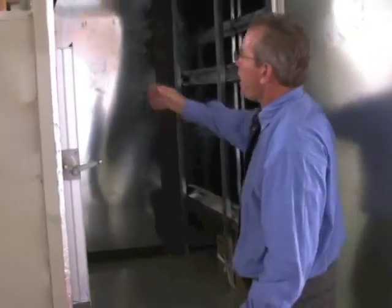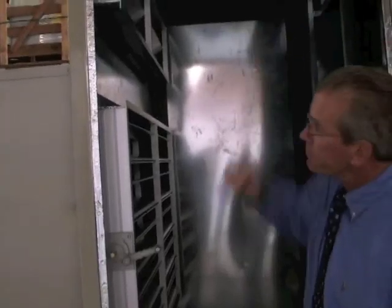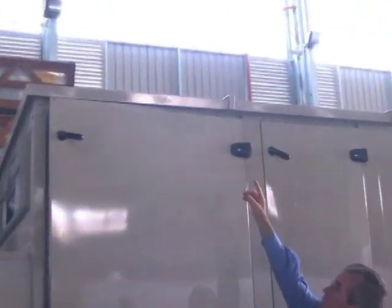You can see that the cabinetry is all double wall. It's actually double-wall galvanized on the inside, and on the outside of the cabinetry is galvanized, then powder coated, then top coated with an acrylic finish on top of the fasteners and everything to prevent rust and give us the best possible duration of the cabinet. On top, the roof panels are all Z-cleated together with an overhang so that there are no seams for water to drip into the unit.